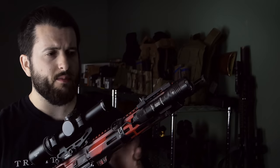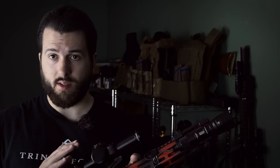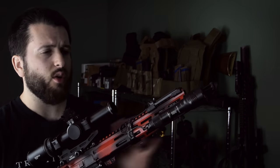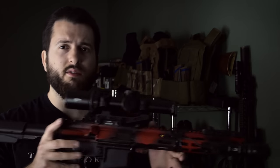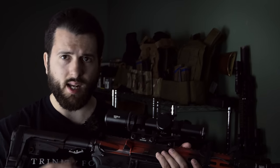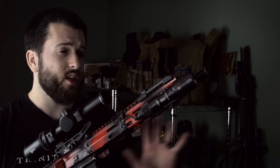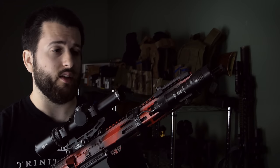What that means for me is that this upper receiver is basically gassed perfectly. Now, some really high-end upper receivers will have their gas turned down even more, like .065 or .067, somewhere in that range. But .070, at least on this barrel in this specific configuration — again, nothing funny going on in the back end, just standard carbine buffer and carbine spring, so a 3-ounce buffer — it is extremely well gassed. I would not change anything in this system.